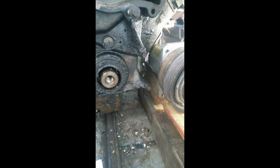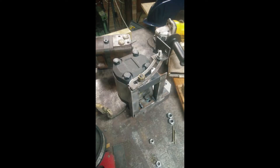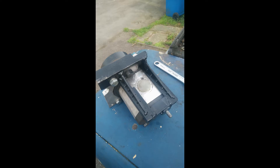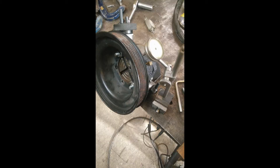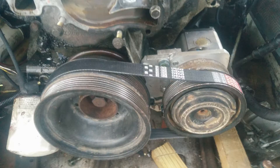Mounting the motor was a little tricky — there's not a lot of room to work down there. Luckily I have a spare V8, so I dragged that out of storage to get the pump mount figured out. It picks up on some existing mounting holes in the block with an adjustable steady at the rear. I didn't use a single piece designed for the front plate for two reasons: firstly I wouldn't be able to swing that bigger part in the lathe, and secondly it makes things quite a lot easier as the intermediate plate allows me some degree of freedom to move the motor. It fits snugly in the only space available at the front under the left bank. To drive it I had to add a second pulley — there's room for this behind the existing pulley, and on this engine they're pressed steel and can be welded. The second pulley was sliced off using the plasma cutter with a rotary table and carefully welded on. Belt tension can be adjusted by moving the pump on its mounts like an alternator.